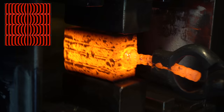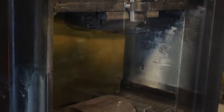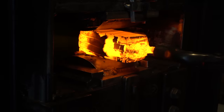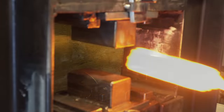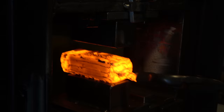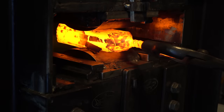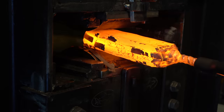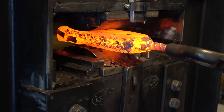Here's a graphic of what our Crush W's are going to look like when we're done. Then we're going to restack and do it all again. Now I'm drawing it out with the drawing dies. We need to get it into a nice long bar because again, we need to cut it up and restack it.